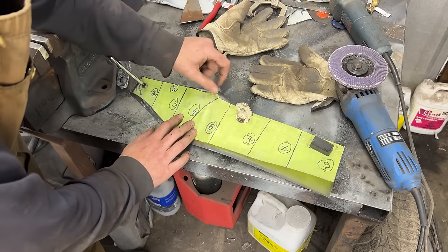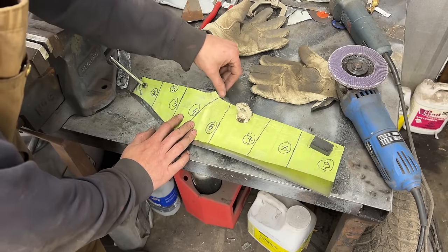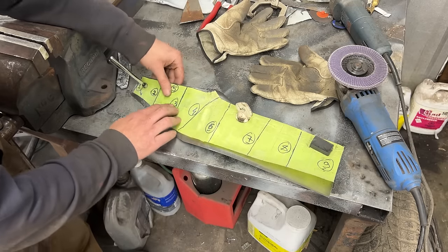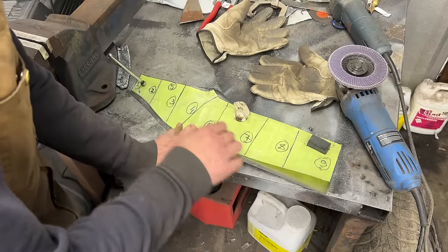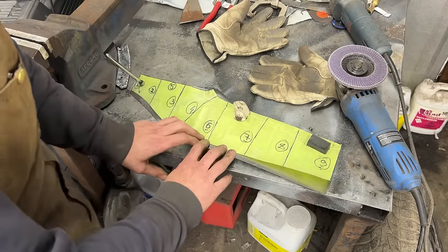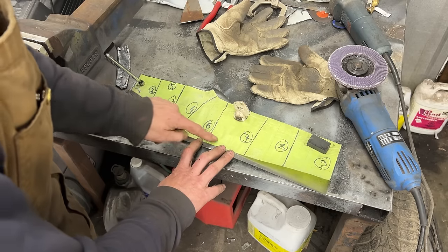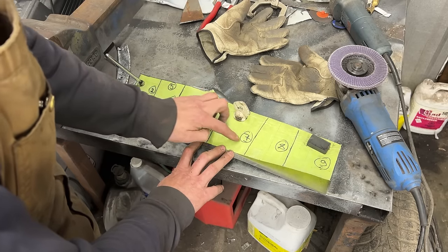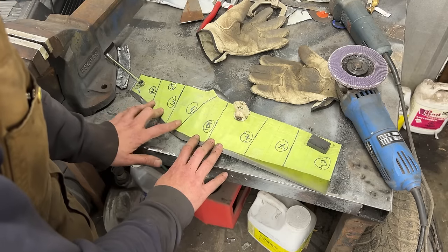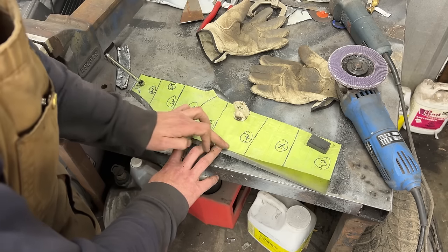But it needs more. So I'm thinking I'm gonna cut this shorter and I'm gonna stretch again with the stretcher to help it, but I'm gonna leave that area for now. That's it. I'm gonna put a much lower crown wheel at the bottom, and I'm gonna start wheeling this area here because I have all of that. And we're gonna keep testing it, and that's the only area actually that we need to stretch here.